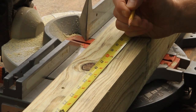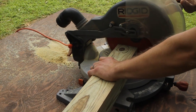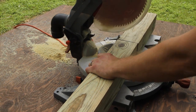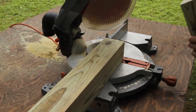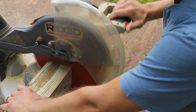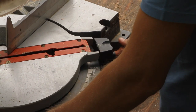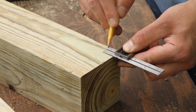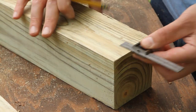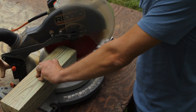While you're already working at your miter saw, it's a great time to make the two end posts. First, cut a 4x4 down to length. Just keep in mind that depending on the size of your miter saw blade, you may need to cut into each face of the post to get all the way through the material. Once you have both posts cut, set the blade to 45 degrees so you can bevel the tops. Mark each post ¾ of an inch from the top and then clip all four corners to get an even bevel all the way around.